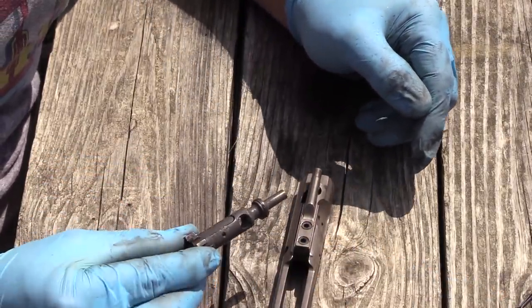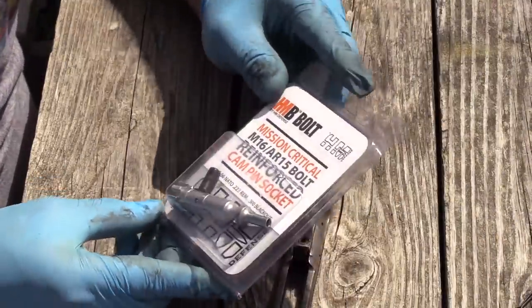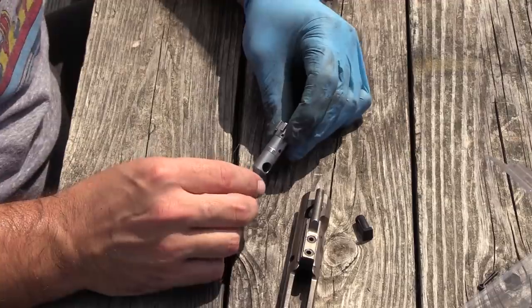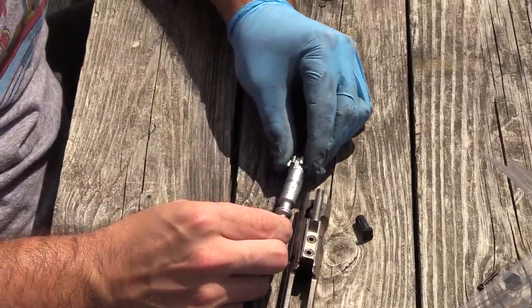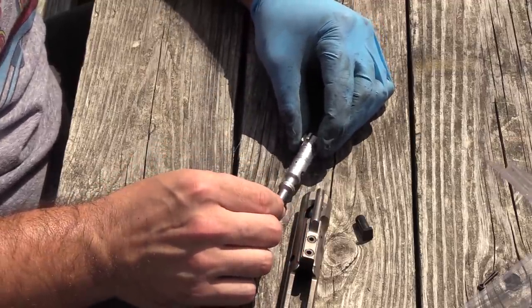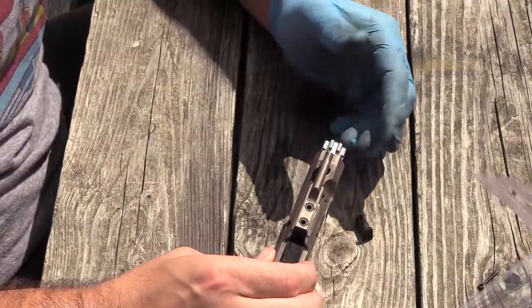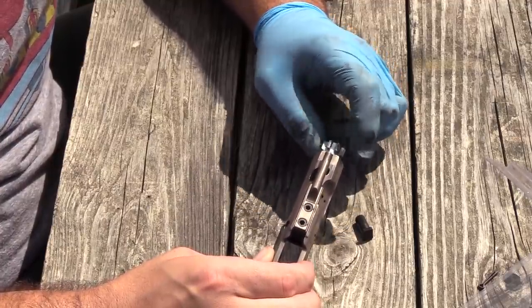The bolt I gave up on. So actually what we're going to do is roll in something I've been meaning to do for a while — this is a collab between HM Defense and Young Manufacturing. Basically what Young Manufacturing has done is reworked the HM Defense HMB bolt. It's an SAE 9310 bolt that has been precision ground in a few different spots to ensure perfect center alignment, or as close to perfect as you can get. Sometimes you can buy a junky bolt and it may wobble in the chamber — but there's no wobble in this whatsoever. You can tell quickly by rotating it, and it should feel like ball bearings. Basically no runout in the part whatsoever.